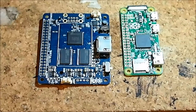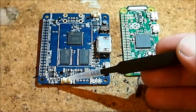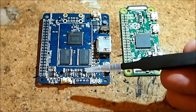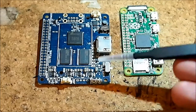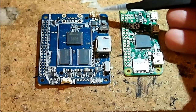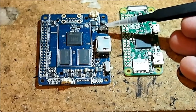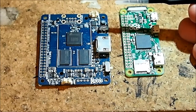There are two more connectors worth pointing out. One is for a real-time clock battery — the C Zero does have a real-time clock, which the Pi Zero doesn't. That's a really nice feature for real-time use cases that the Pi Zero might not be suitable for. The other connector is for a standard LiPo battery at 3.6–3.7 volts. The C Zero has a charge controller with both step-up and step-down capability to run the entire system-on-chip and recharge the battery from the 2.5mm barrel connector. So the C Zero has almost everything required to run off a battery, except for the battery itself.